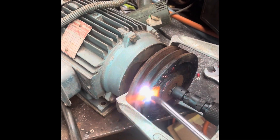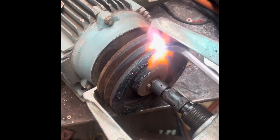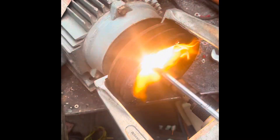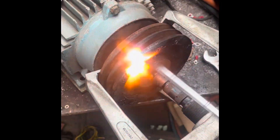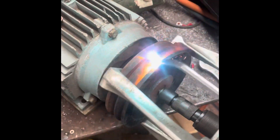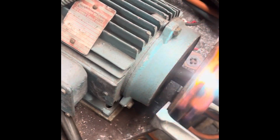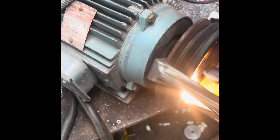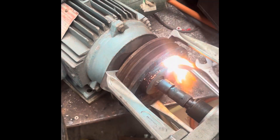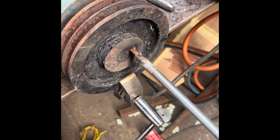Audio note: we're heating up the pulley with an oxy-acetylene torch. We could not get that pulley to move with an eight-tonne puller - we started with a three-leg puller and it wasn't moving at all. Added heat, tapped it with a copper hammer, tried everything - it wasn't moving. The next job was to try removing the key manually - punching from behind, chiselling from the front, grips - nothing was budging. So I got a slide hammer, welded it onto the key, and pulled the key out that way.